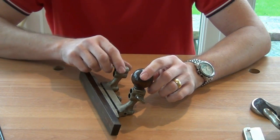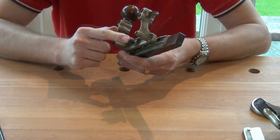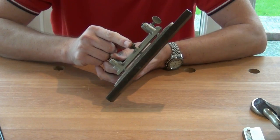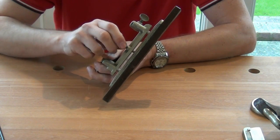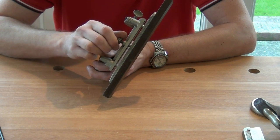The fence is also carried on the parallel rails. There is an adjustment on the fence — it is not on all models; some of the early ones did not carry it. It allows us to adjust the fence, which is a lot easier than just moving it on the parallel rails.